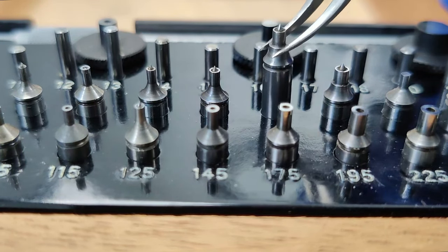Okay, checking the motion of the wheels. Nice. And we'll get the ratchet wheel down. Now Hamilton, of course, started out as an American watch manufacturer in the 1890s, but eventually was acquired by the Swiss in, I think, the 1970s, and is now part of the Swatch Company. Let's apply some D5 oil here before setting the crown wheel. Some crown wheels are secured by a reverse threaded screw, but in our case, there are two little screws that do the job.